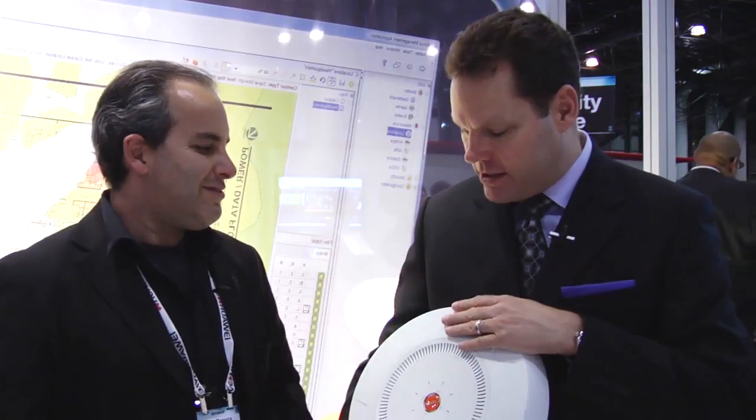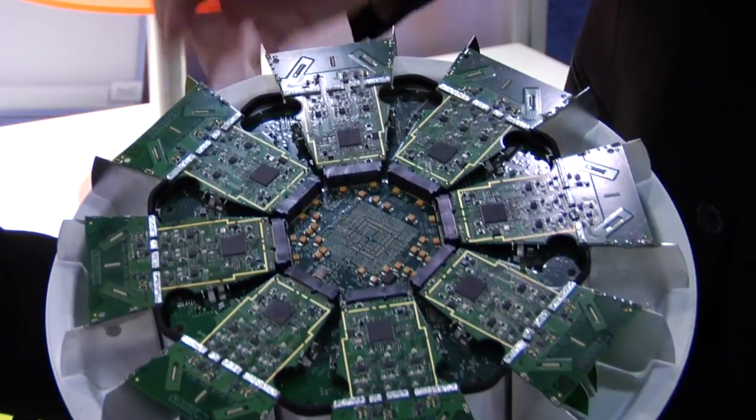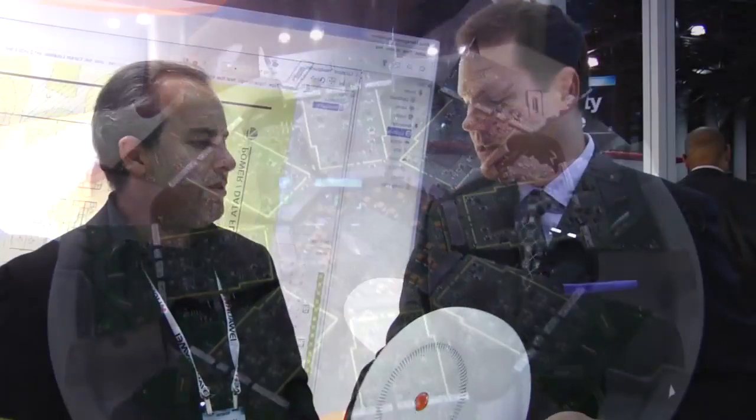Yes, we are. We've got a new generation of Wi-Fi array. A Wi-Fi array, simply put, looks like this. This device has built in a wireless LAN controller and eight integrated access points. That's quite a bit different from what most people think of when they think of a wireless access point — there are actually multiple access points in this device.